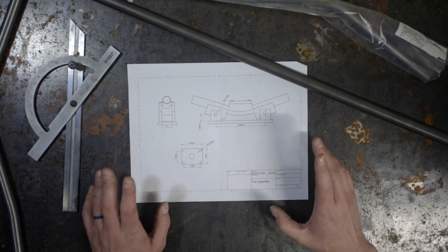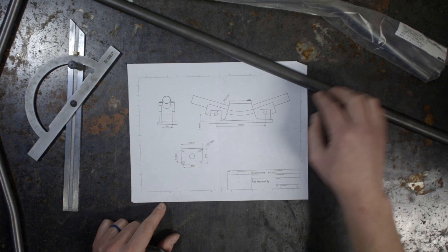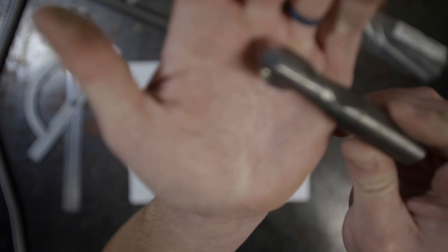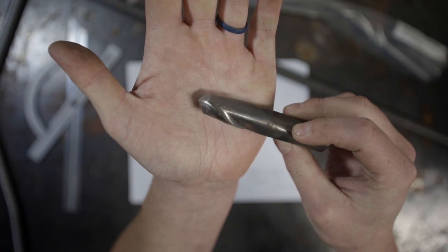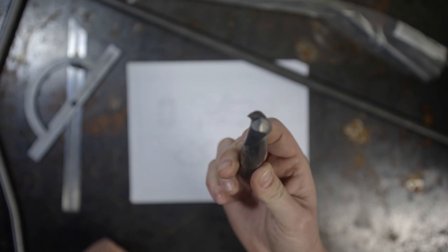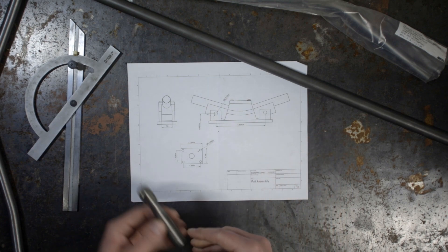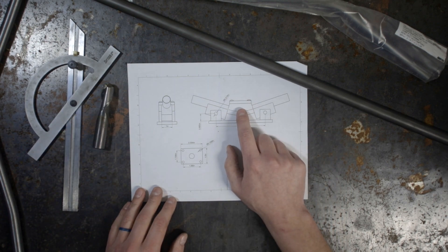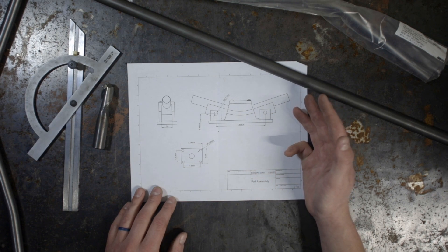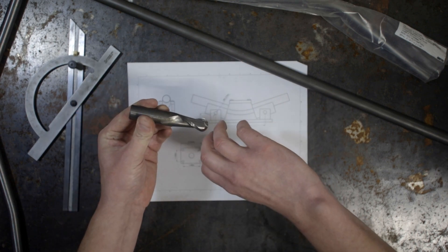We need to be able to cradle this round tube. On the two outside sides it's just a straight die — pretty easy. You can take something like this: if you have a Bridgeport or access to one, you can get a round-nose or ball-nose end mill. Running it through a piece of aluminum gives us that nice half-round profile. That's the easy part. The hard part is the die in the center, because it has to match the curve, and on a manual mill you can't really do that — you'd need a rotary setup.